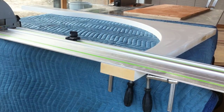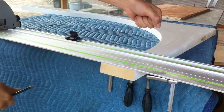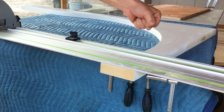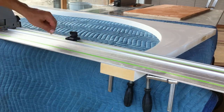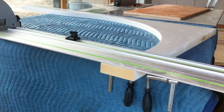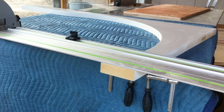So we're going to have to run the saw backwards, and you just have to be really careful when you do that, because obviously it's like a climb cut where the tool is wanting to push the direction that you're moving it. So I've got my stock set here to prevent any serious catastrophes, and I'm just going to run it at a very slight depth through the backwards part of the cut and be really careful.